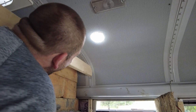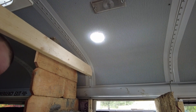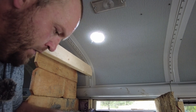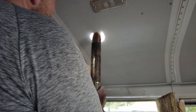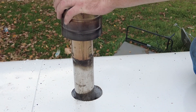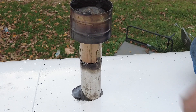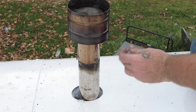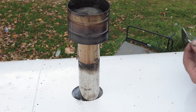Now we're going to put the stove pipe together. I do have one special one right here that's got these little deals for putting wire on. That ain't going to be quite tall enough, is it? That looks a lot better — yeah, I like that. So I'm going to put a couple of self-tapping screws — I'm just going to use two of them. I'm going to connect this pipe to that pipe, so that way when I do need to clean it, I can just take one of these out and clean it.